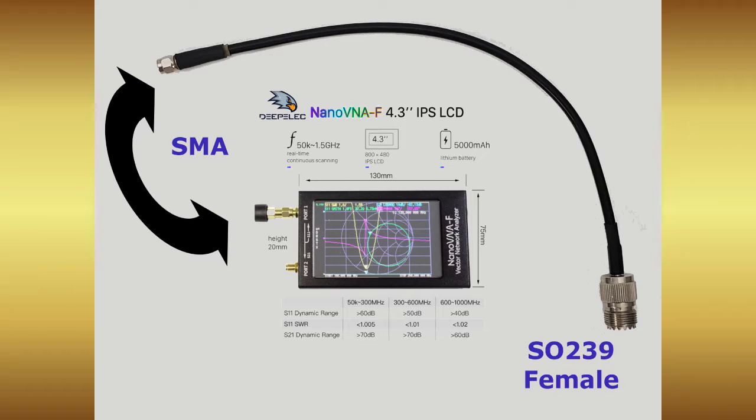I will try to demonstrate the Nano VNA's ability to factor out intermediate cabling characteristics from the measurement by calibrating to a distant plane.